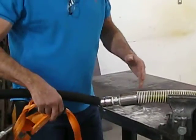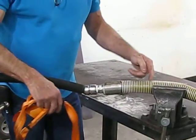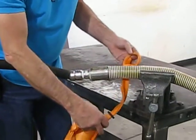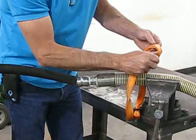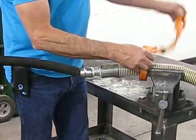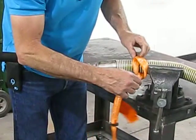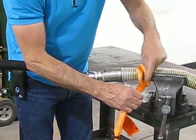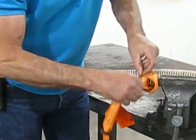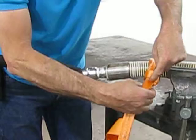On your hose that you are wanting to secure, come six to eight inches off of this fitting right here. We are going to simply run it around like this and then slip your nylon choker through this knot here, through the slip knot. Bring it up like that and then tighten this up. Slide it down as you are working it and see how it cinches in on it.